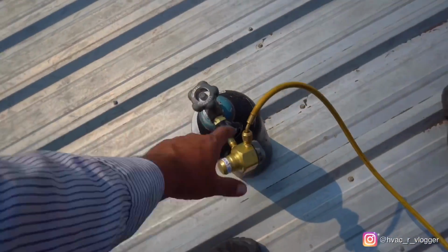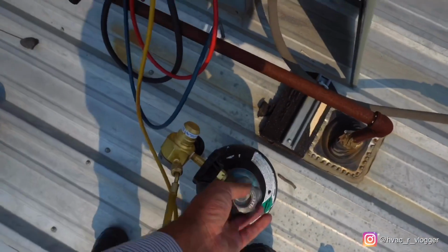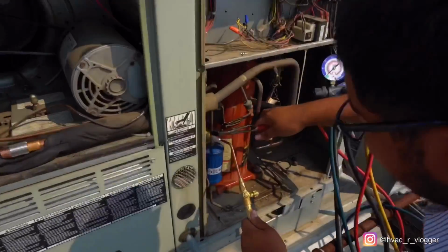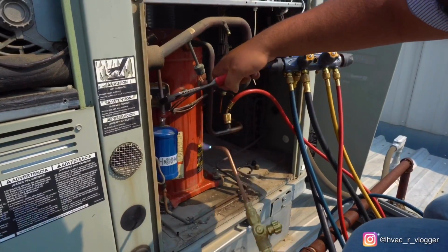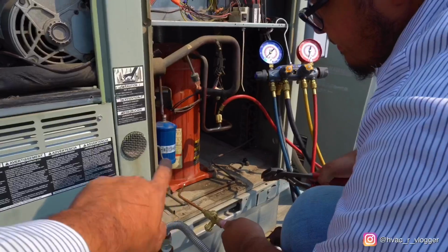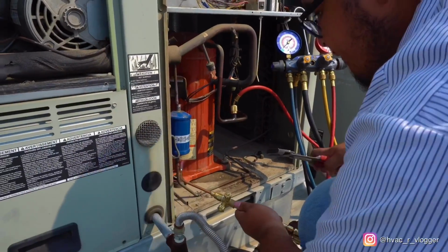And yeah, guys, we are brazing with nitrogen. Go ahead and put it over here. Yep, just like that, heat it up. Perfect. All right, hold it for 5 seconds. All right, you're good. Now do the bottom one. Anytime you braze, bro, also remember there's always gonna be wiring on the side. So always just pay attention to those little details.